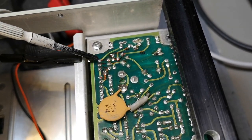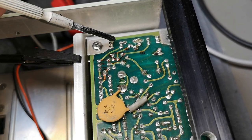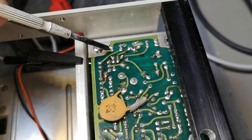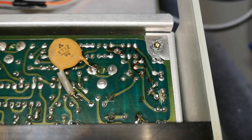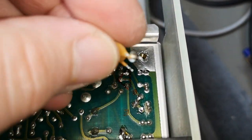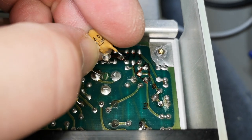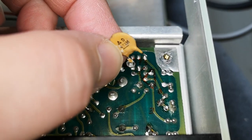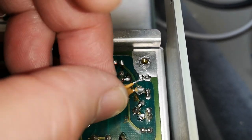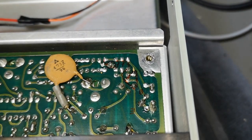There's a short somewhere — there's voltage on one side but not the other, and only a resistor and capacitor to ground between them. So I'll investigate. I removed the capacitor first — most obvious thing — and now the short is gone. But when I measure the capacitor, there is no short and it reads exactly the correct value. That's weird. So there was a short in the soldering, or I repaired the capacitor by desoldering it.